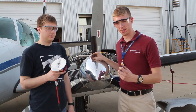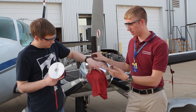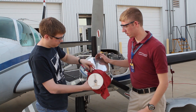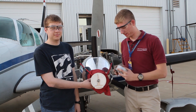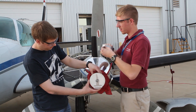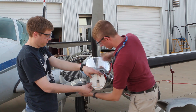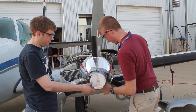Now we're ready to find the correct crankshaft position for timing the magneto. To do that we will use this timing can and mount it to the nose cone of this engine. We use this rag to protect the metal surface of the nose cone. Now it is time to duct tape the snot out of this timing can because it is very important that it does not move. I think it's good.